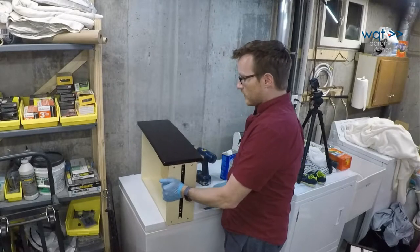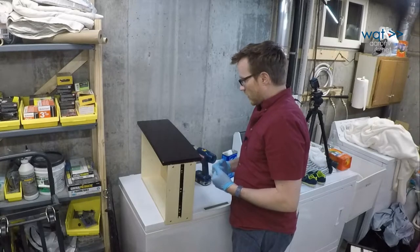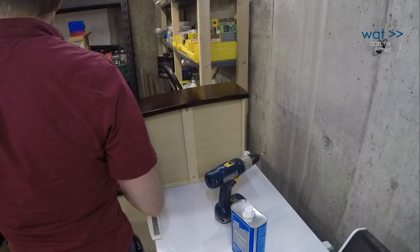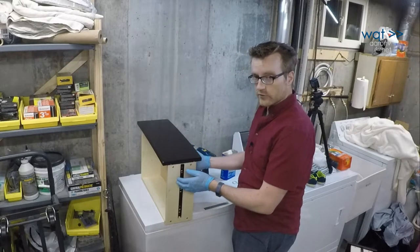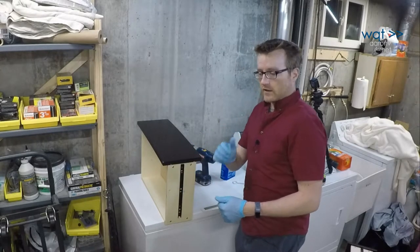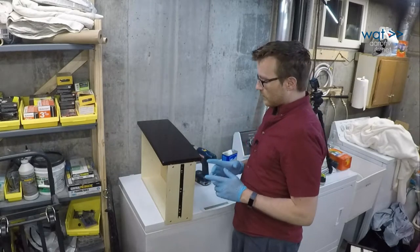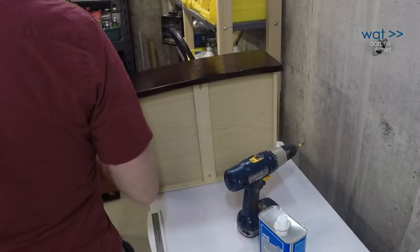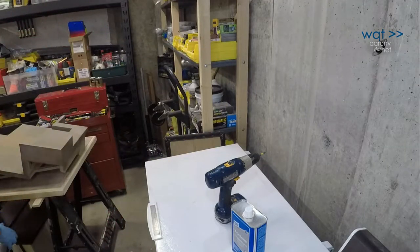And that's something people don't necessarily realize when they buy self-assemble furniture. Yes, it is built so that you can put it together quickly using just a screwdriver or maybe an Allen key wrench. And this has both. The drawers use screws. The main unit uses a lot of Allen key pieces. But if you don't put glue on the seams like a proper carpenter would, they will loosen up every single time. But okay, this one here I just got through working on, so let's pick up another one.